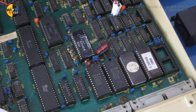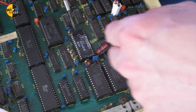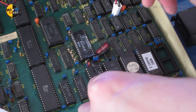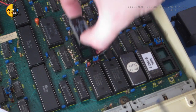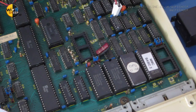I don't have any special tools for doing this, so I'm going to have to very carefully use a flat head screwdriver. The problem is you've got resistors and things so you don't want to damage anything — just trying to squeeze in... there we go. That's kind of not too bad — we've not bent any pins, and there's the old ULA chip being removed.